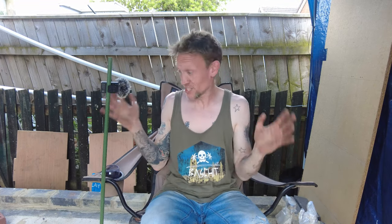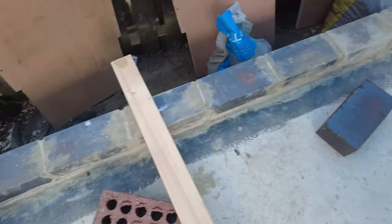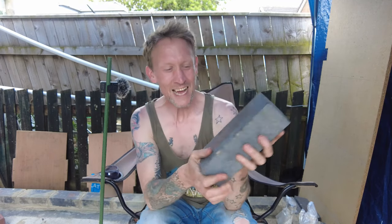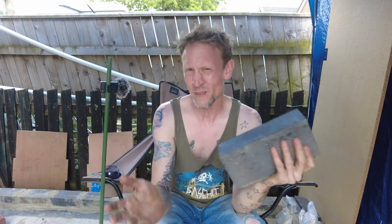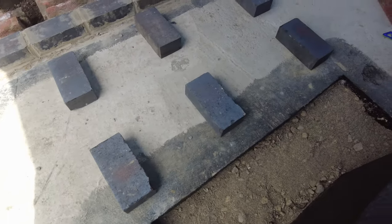Key features of this platform: first of all, I've laid some bricks around the perimeter. I've already given you the dimensions and double-checked everything's level and spot on with the measurements. I used blue engineering bricks — quite a heavy brick and a good-looking brick. The main reason for this is I wanted a solid brick base that'll make things a lot easier when I put the frame on. I got 60 of them altogether and will probably need another 10.